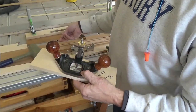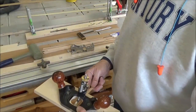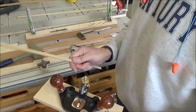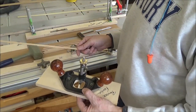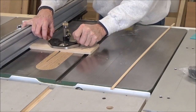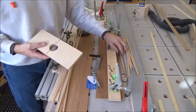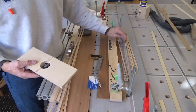The cutting blade will give me a rabbet about a little over half the width of this piece. I'm hoping that will first capture the piece, and even though they've got some pretty good bends in them, it will keep it fairly straight as it runs through here. Then I'll just gradually lower the bit — I only have to take about eight or ten thousandths, the thickness of a business card. So two very light passes and I think that will suffice. All the small ones slide perfectly — that's nice. So I'm going to keep this setting where it's at.